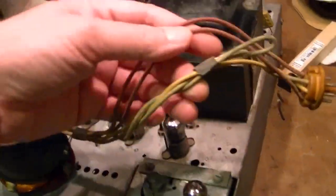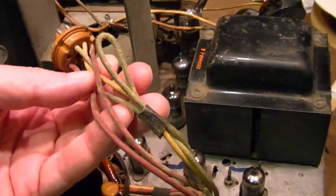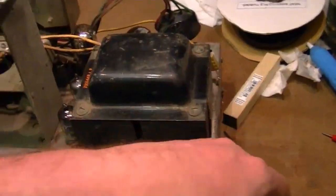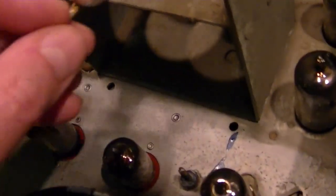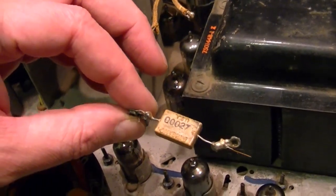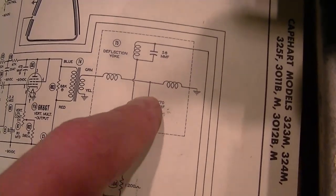Off the top of my head, I would guess that fifth wire that loops back is the center point between the vertical or horizontal windings — they don't need it for this configuration, but maybe other sets might. So, get the plug off and figure out which four wires are horizontal and vertical. I believe it's the 56 picofarad cap — that should wire in down to the appropriate cap. And this one was going to the 270 directly, so I would guess that's got to be this wire, since it's the only one that attaches right to the 270.